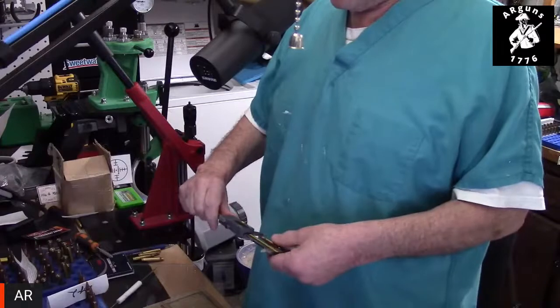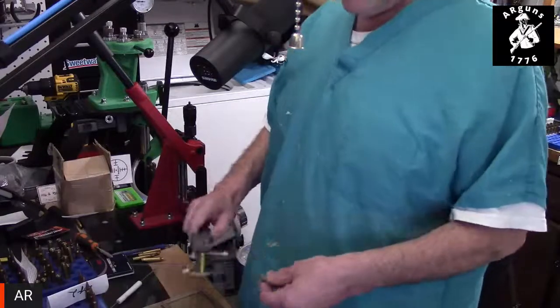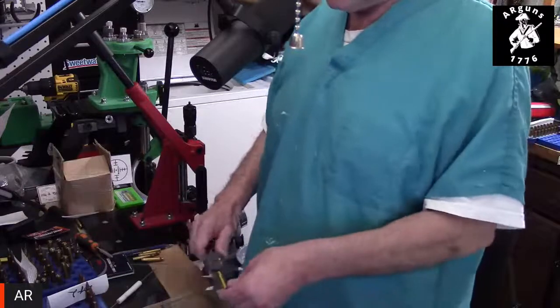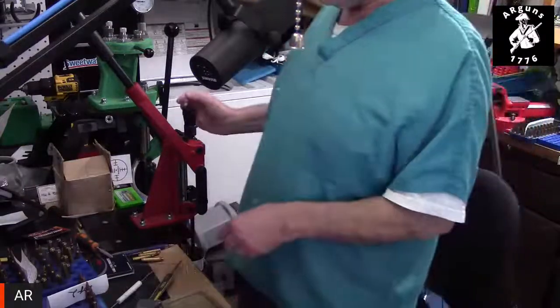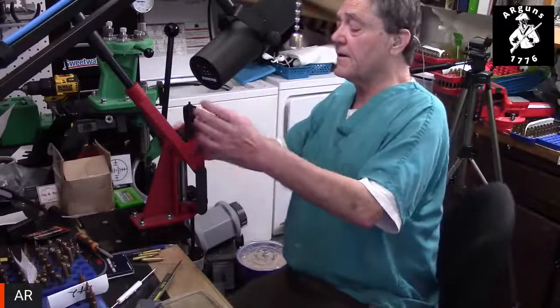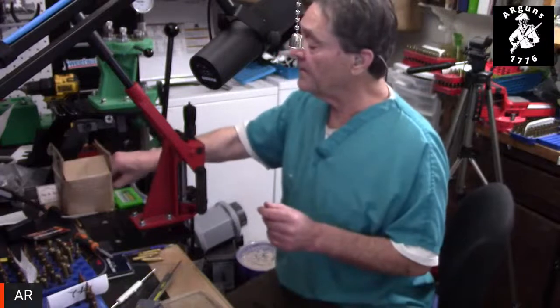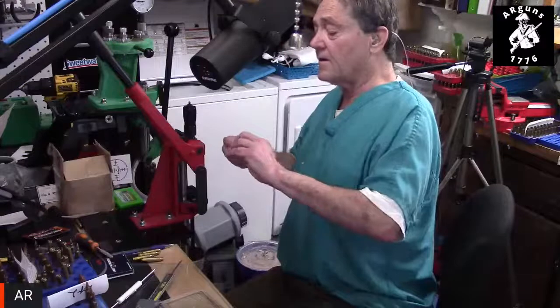We're sitting at 2.219. So we're 19 thousandths off our target. 19 thousandths of an inch. I'm not going to go down 19 thousandths. I'm going to go down less. Hang on, let me tighten this. Go ahead and tighten this locker ring up.